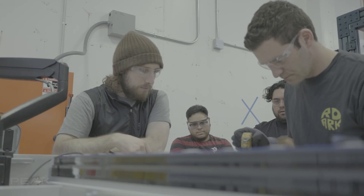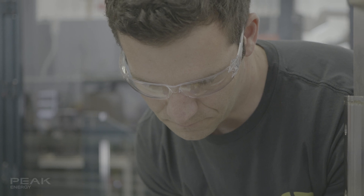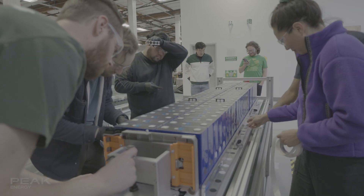At this point we're able to band them so that they can be self-sustaining, and then we laser weld and interconnect their terminals so that we can build the brick voltage throughout the sub-module.